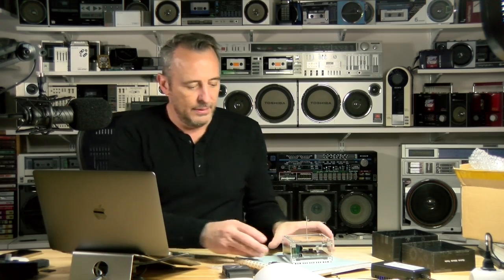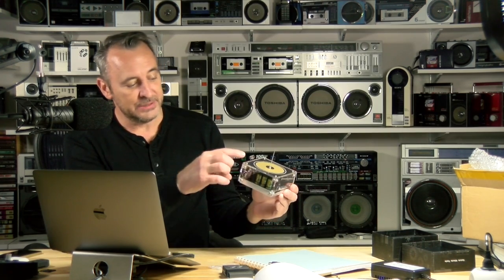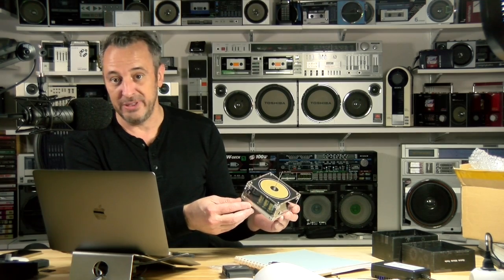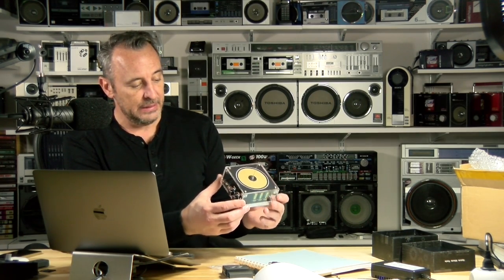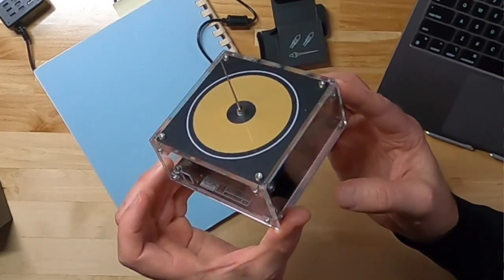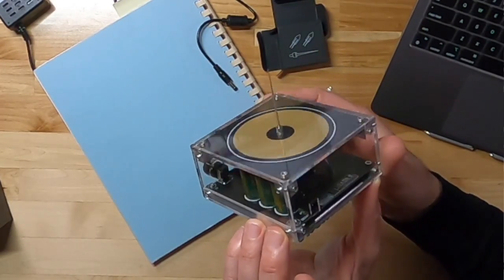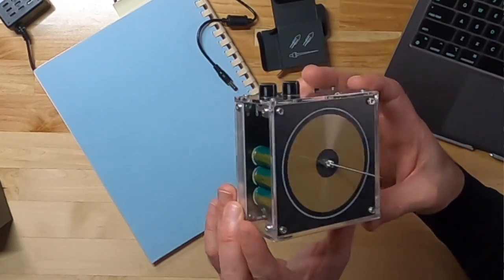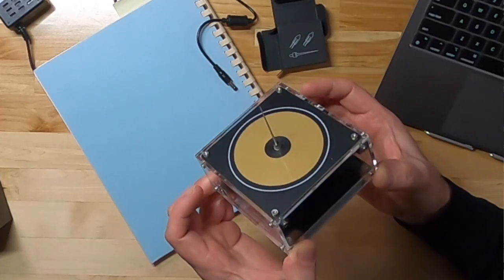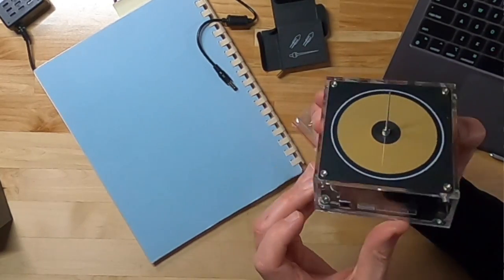Okay, so we're back. What did you think? Isn't that impressive? I didn't really get it all the way up because it was arcing over to the sides — I was probably three quarters of the way up. But that was a good four inches or better. That is super impressive, because if you look inside, there's a ribbon cable feeding both the secondary and the primary on the same cable. That's super impressive. So that means the ground and the power for the primary are both going in the same ribbon cable, because there's no metal connecting the top board to the bottom.